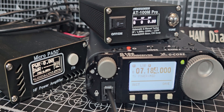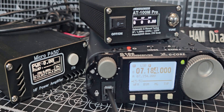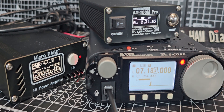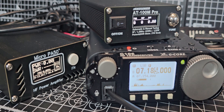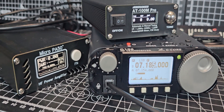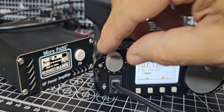I'm not going to do 5 watts — I don't want to damage the amplifier, which really doesn't want more than 5 watts through it. Let's plug the microphone in. When you're in a menu you can't transmit, so make sure you're out of the menu. Calling M0FXP — watch, we're going up to 50 watts! The SWR is 1.5. M0FXP calling for a contact on 40 meters. It fluctuates when doing voice, but on CW or digital it stays more steady. The PA50 is working really well. Let's see if we can get an actual contact.